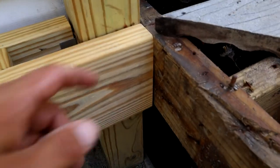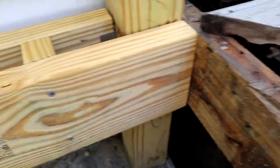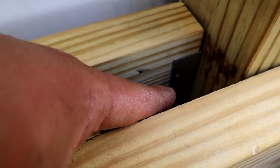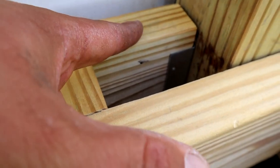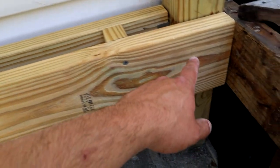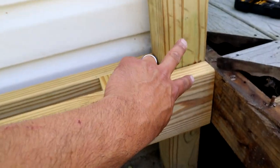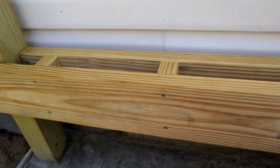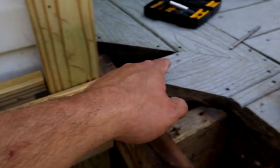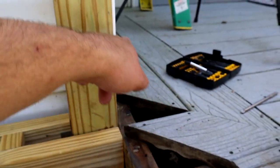Here's the finished product. Everything's looking good, nice and level over here, happy with that. The only issue I'm going to have is getting nails into these joist hangers into the actual joist, so I'll probably just have to toe this in up top. Don't forget these are going to be carriage bolted to the post as well on the front here, so this is going to be plenty strong. The back of this is really only support to put the picture frame boards for the deck back in here.